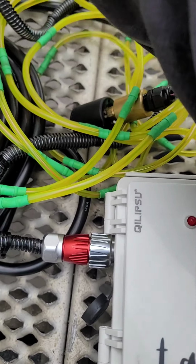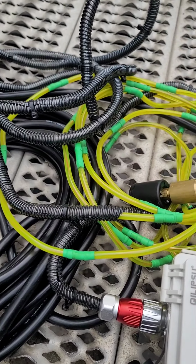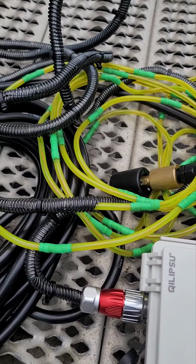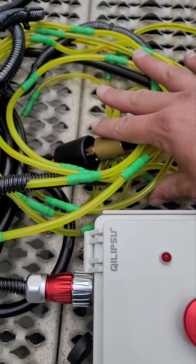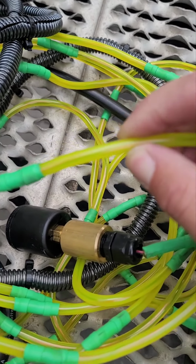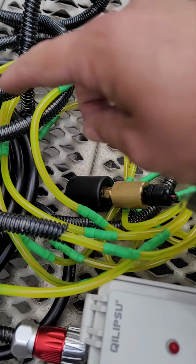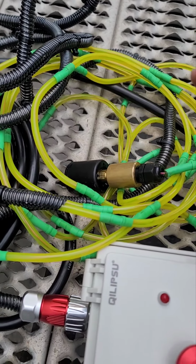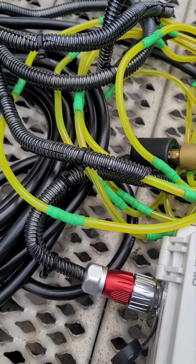If you want to add more cable like I did, like I added right here, you can see where the wire loom is. It has to be outside the tank area. So you cannot add anything inside the tank. It has to be solid wire. You can tell inside this Tigon right here, it's solid wire. It's solid wire for 20 feet, okay? So you cannot have a breakup connection inside the tank. It has to be solid wire.